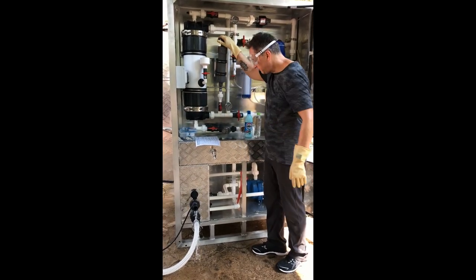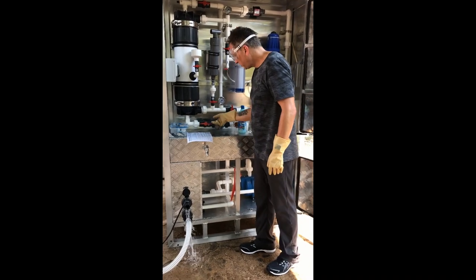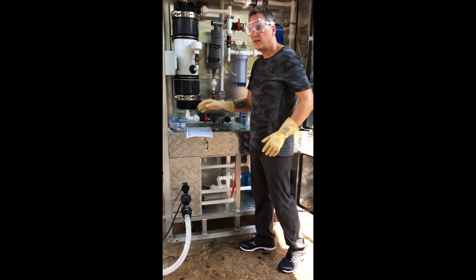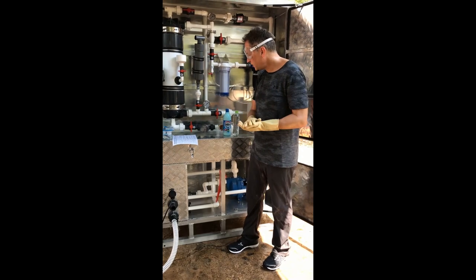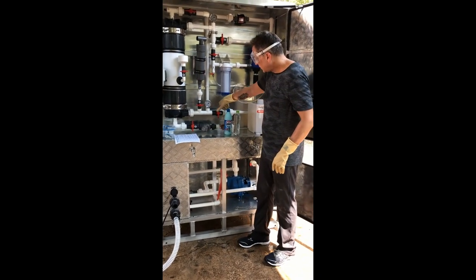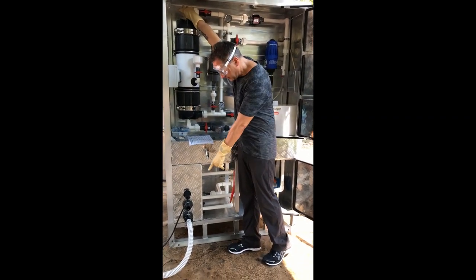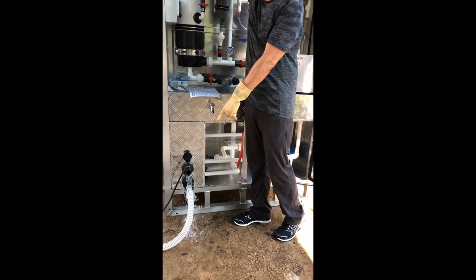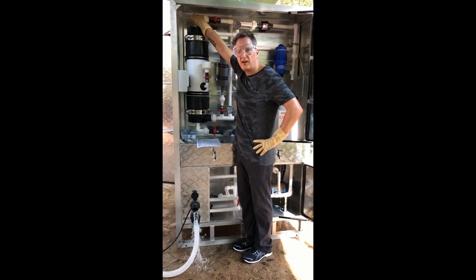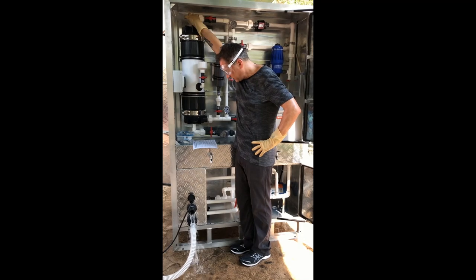After 25 pumps on the air pump, we close valve 7, then close valve 9 and immediately shut off the pump — whether you're using the petrol pump, electric pump, or Saji pump. The next step is to open valve 8 and press the air release valve number 16. This allows us to drain the filter of the water inside the filter. Keep your finger on the air release valve number 16 and hold it in — you can hear the air going in as the filter drains.